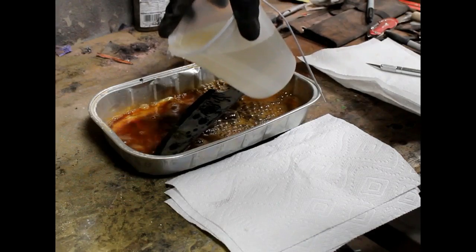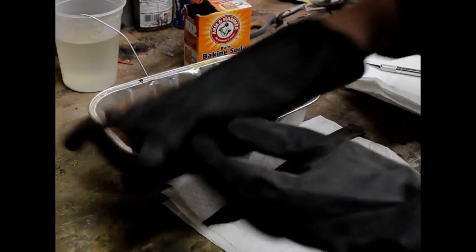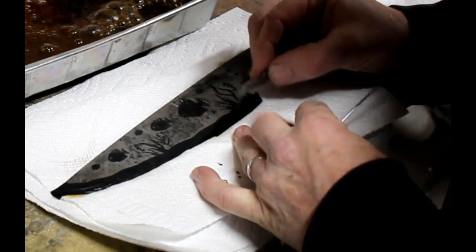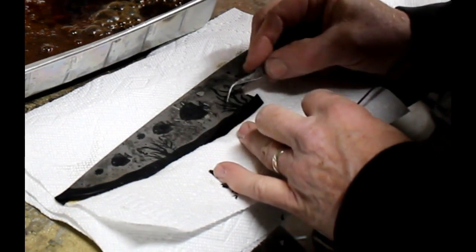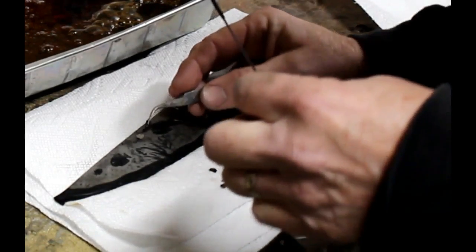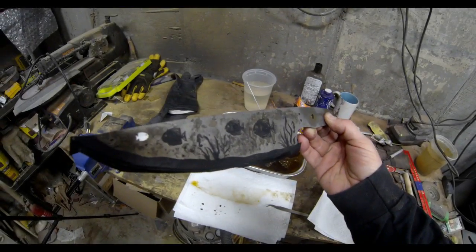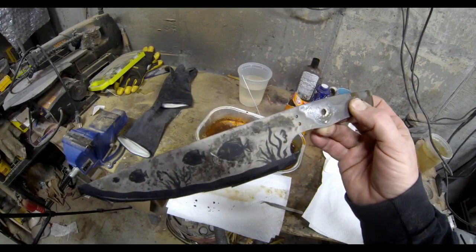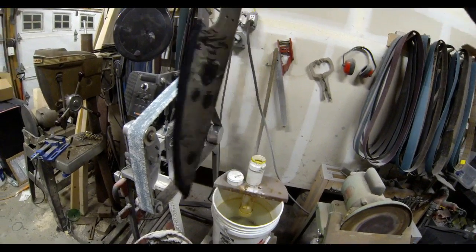Normally after electro etching I remove all the vinyl decals and clean up the knife, but I wasn't able to do that in this case. So I actually put the entire knife — still corroded and cruded up from the electro etching — directly into the acid. I didn't know what to expect. Then I removed the vinyl from the objects I wanted in the background. The vinyl does get a little stiff and more difficult to remove after the acid etch, but it's not undoable — it just takes a little more effort. You can see the shiny fish there; those are the background items. I'm then going to put the blade back into the ferric chloride for another 15 to 20 minutes, just to darken up each of those background items.